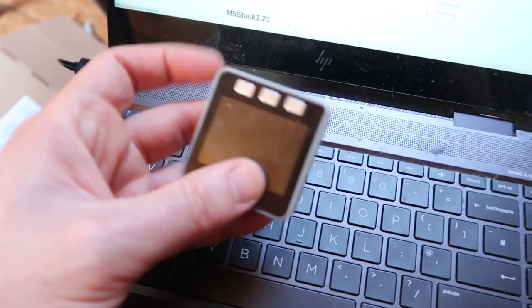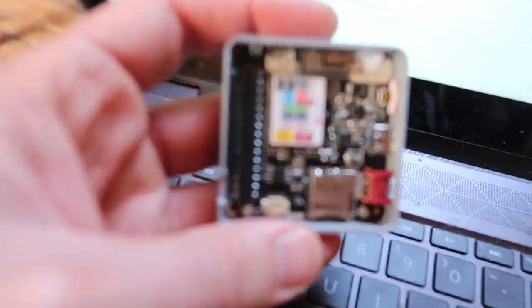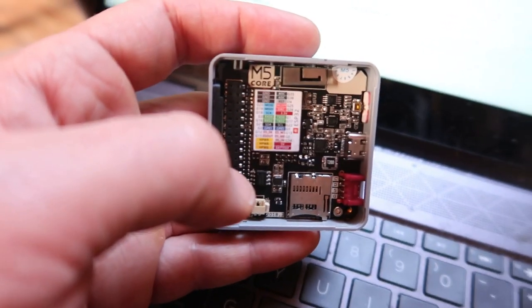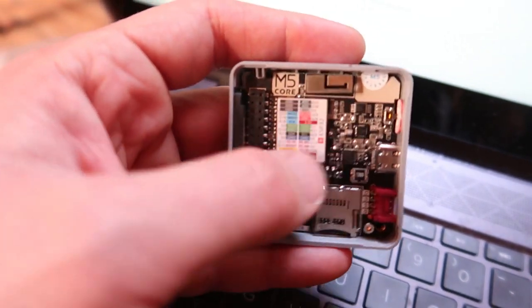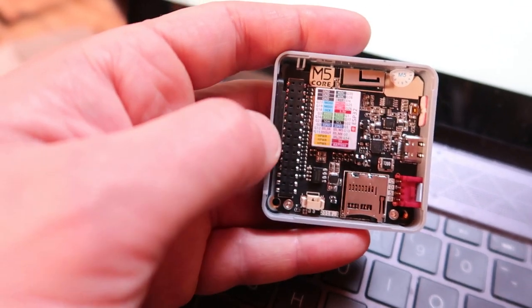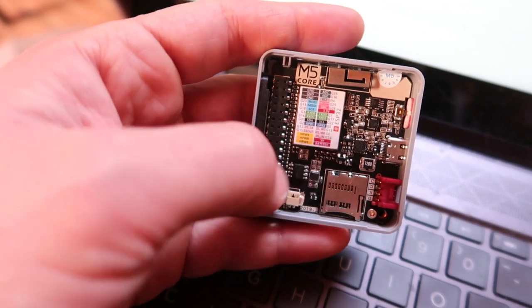When you receive your M5 stack, you can take the back off it, which is the battery part, and that'll expose the internals of the M5 stack unit. Let me see if I can focus in there. There we are. Right, so there's an ESP32 in here, then there's a bunch of connectors and other things, so it's their own prefabbed board. There's a whole bunch of GPIOs here, and they very kindly put in a nice pin map for people like us who like to take things apart.